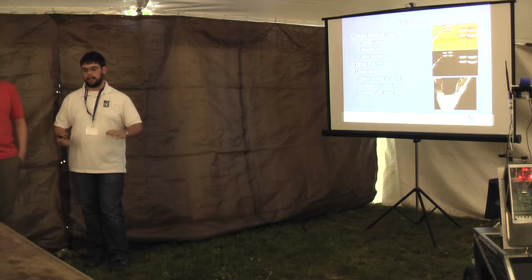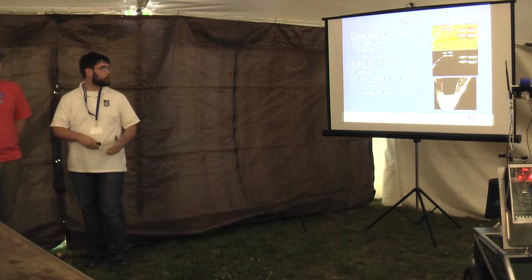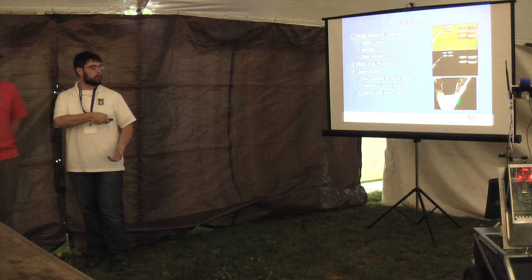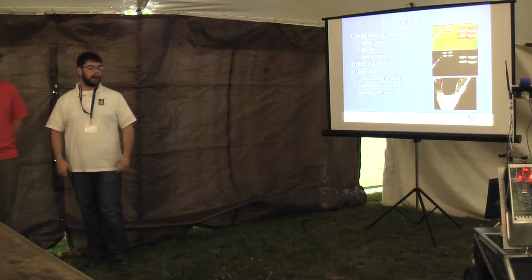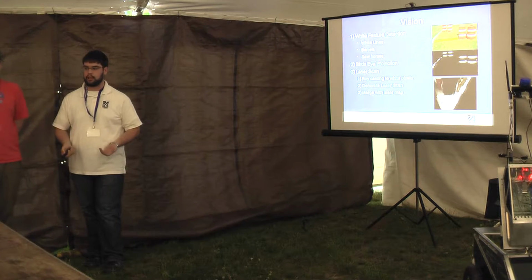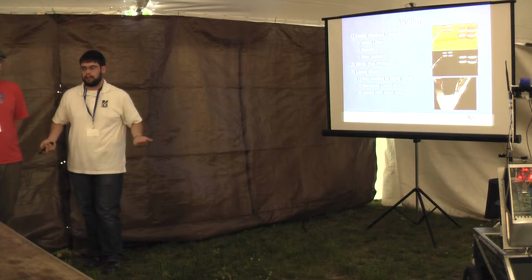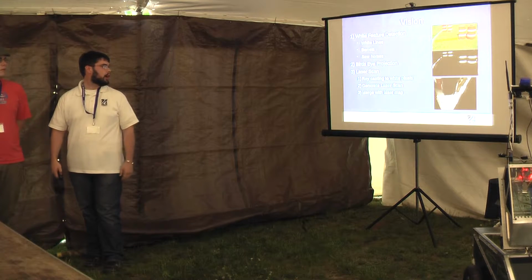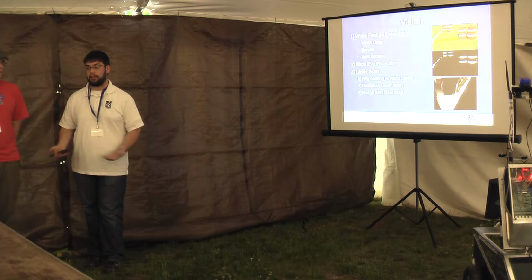After we get a segmented image, we do a bird's eye perspective transform. We get a top-down view of the field in front of our robot. You can see this checkerboard was warped back from the projected view. After that, we do a raycast to simulate a laser scan. This gives us 180 points in front of the robot, with a good distance for each since we fake a laser. After that, we convert to laser scan messages.